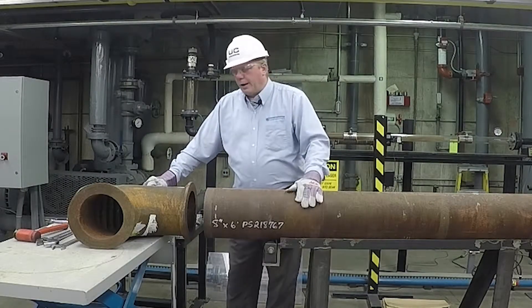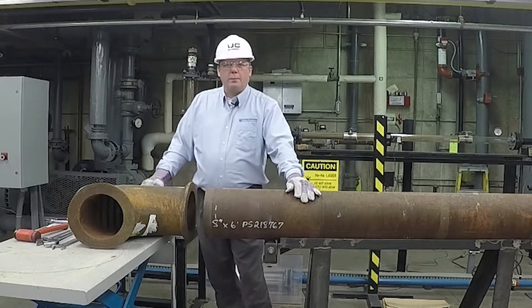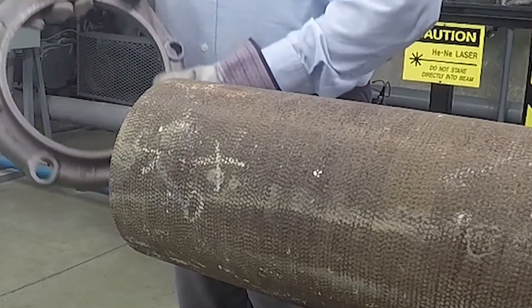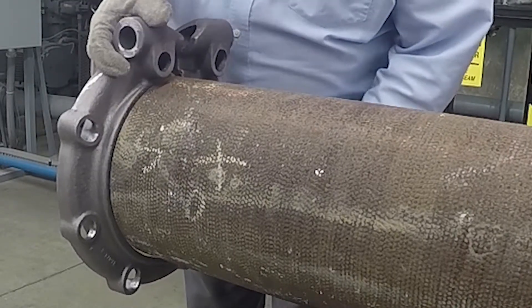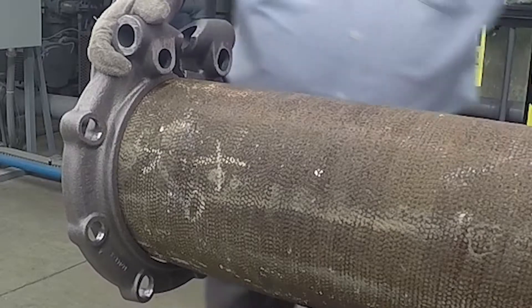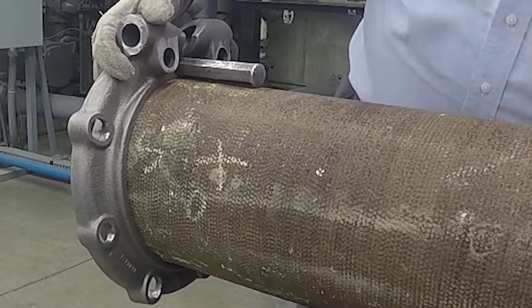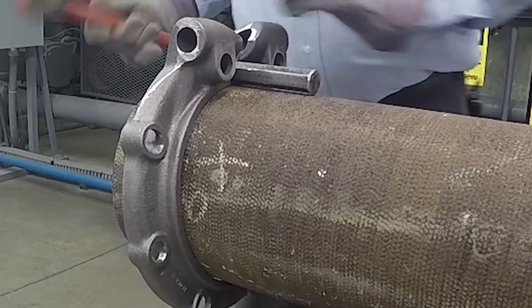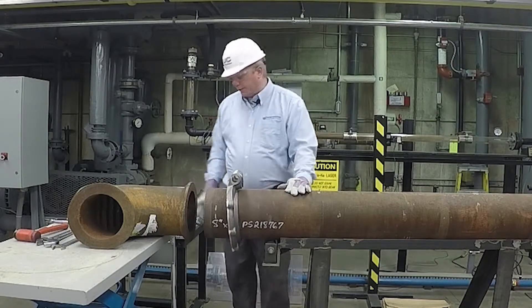Let's get started. Once we're at our work site with all parts inventoried and all tools ready, we can proceed to make the connection. When installing the locking ring, due to the casting of the Nouvelloy pipe, it may not slide right on and may be a little tight. You may need to use a wedge to open the locking ring slightly so it slides onto the Nouvelloy pipe. That'll be a fixed flange once it's all tightened down.